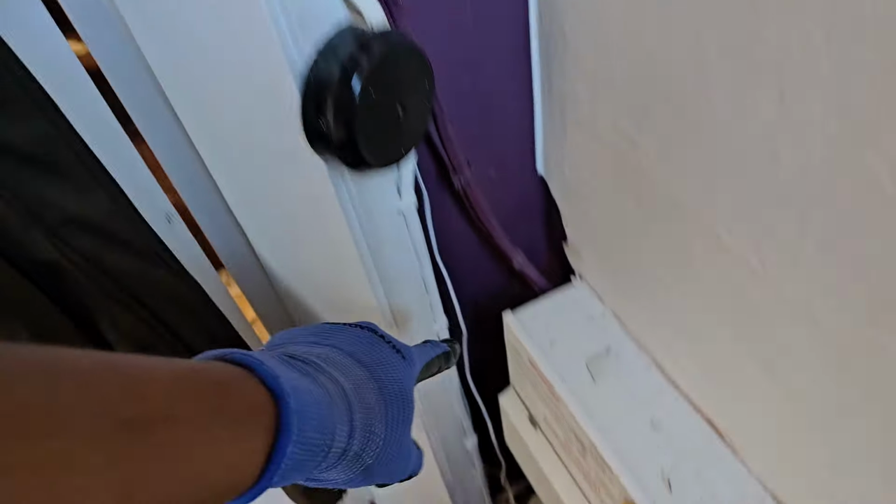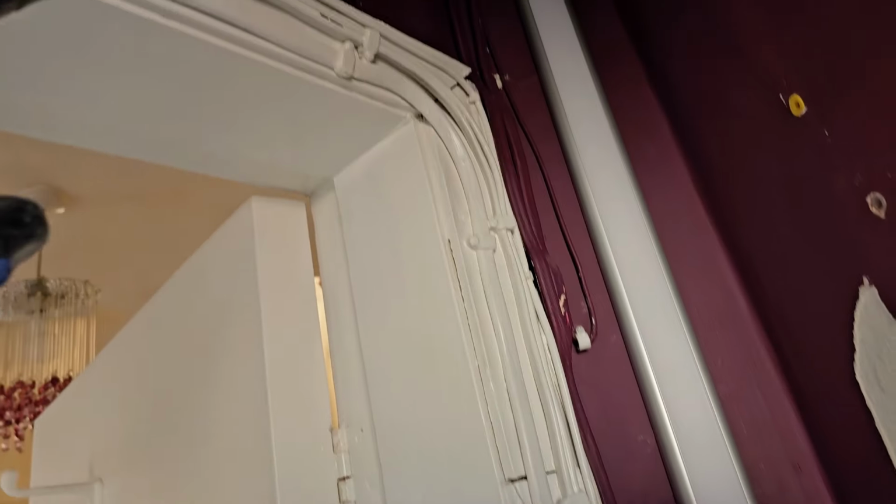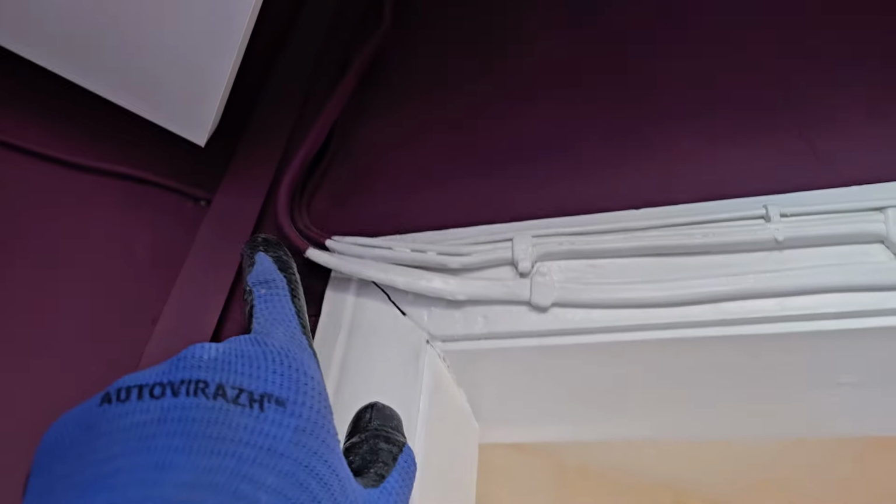So I'm also going to get these wires here from the consumer unit. I think the supplies are socket and these are probably lighting wires. There's enough slack here because it zigzags around there. If I can get it pushed into the wall, chisel it out basically, and get it into the ceiling when I remove this wall.